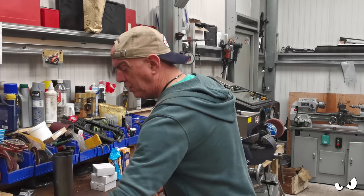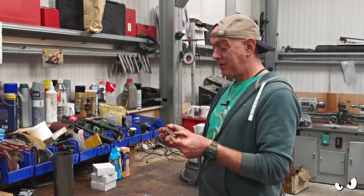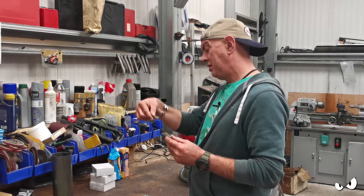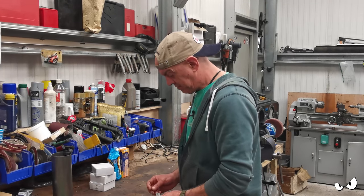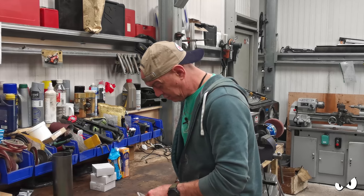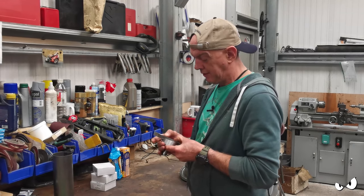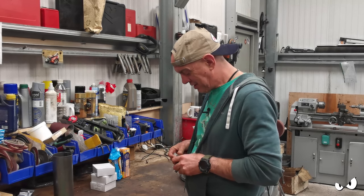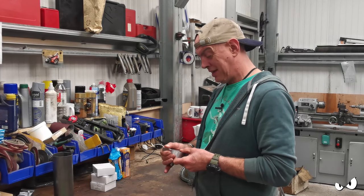So what I'm doing, I've got two sets of feeler gauges. One I use for measuring stuff. The other one is just shim stock, and it's brilliant because it's written on there what it is. What are we? 0.18 mil, and if I shove that in the back there, like that, then my tool is properly snug. Go on, you know you want to. It will go, there we go, like that. That's the fit that I should have got when I machined it, and I didn't.